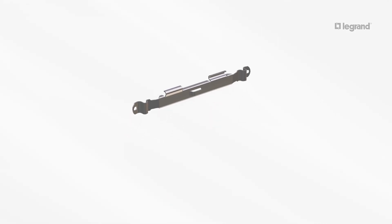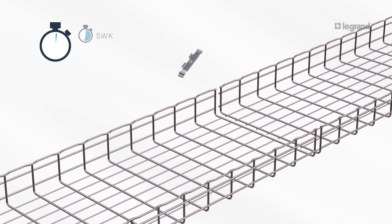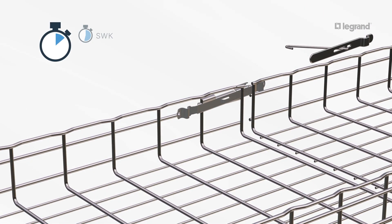EDRN is the fastest means to creating a UL-classified wire mesh splice joint. Orientation of the splice prior to installation is the key. Make sure the top wire tabs are facing the topmost wire of the tray.